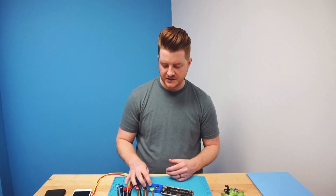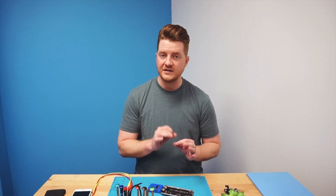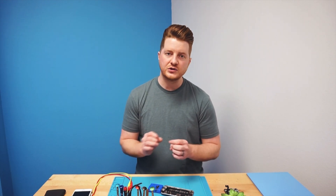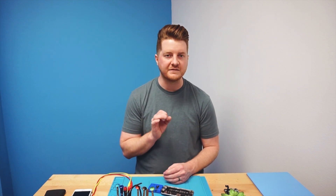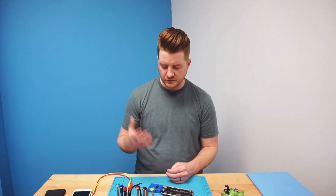This particular tester is pretty cool. It tests the individual lines of the internal part of the charge port and then compares those with known goods in order to determine if the lines are within tolerance, giving a pass or fail reading. It's not 100% foolproof, however it's incredibly accurate — I've only had a few rare cases where it gave an inaccurate reading. So whatever the results tell us right now, it most likely is going to be that.